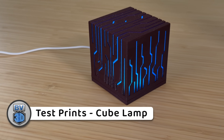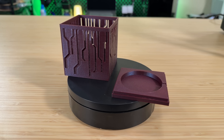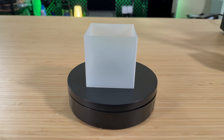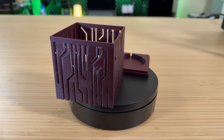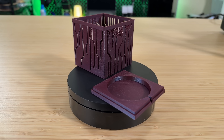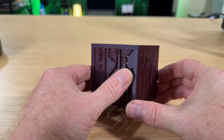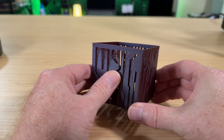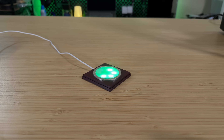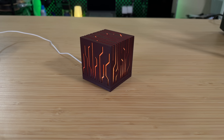This is a cube lamp by designer Severo on Maker World. I printed it using standard settings at 0.2 millimeter layer height, again using the Marsala PLA. The base and the slotted outer section took about two and a half hours, and the diffuser took another hour — about three and a half hours total. The main issue is the geometry of the model: the box's walls are thin, and the cutouts are thin too. Once the print reaches a certain height, those sections can flex as the nozzle moves, giving a rough, uneven surface finish. I think printing with supports enabled could help stabilize those wobbly sections. The internal lighting is a color-changing LED puck the same size as the white LED puck Bambu Lab sells for their lamp kits — I'll put a link below.